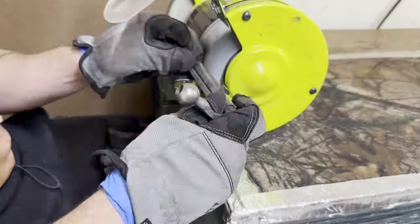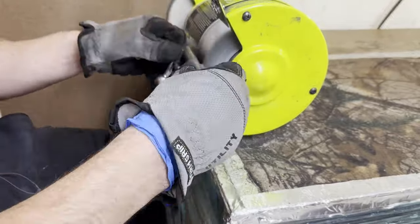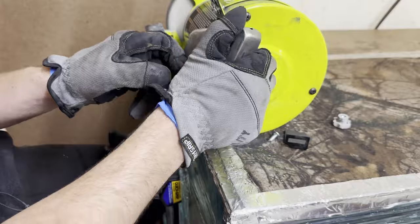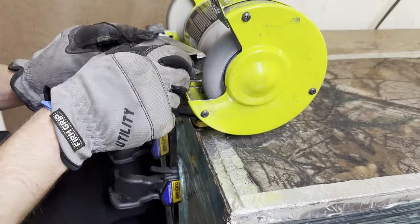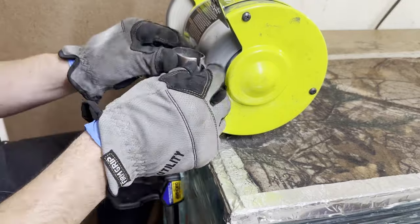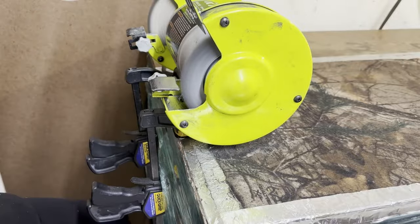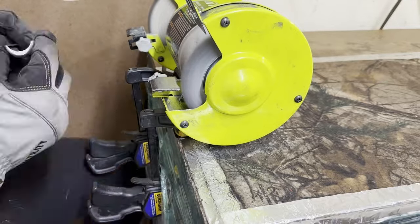Back to the actual restoration — the next step is wire wheeling. Previously when I was doing cold bluing, I would sand down all my parts to get that nice shiny metal finish. With rust bluing, you really don't need to do that. Rust bluing is inherently rougher on its own — you're not going to be able to tell how shiny the underlying surface is, so you don't need all that fine sanding to get a mirror-like finish. Using a not-too-abrasive wire wheel does the trick pretty good — this mostly ensures all the old bluing and rust is off and we're left with bare metal.